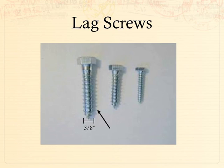The head of a three-eighths inch lag screw is actually nine-sixteenths inches. So when you go to get a socket for driving these into the wood or material, you have to get the appropriate size socket. You could try to use a crescent wrench, but it doesn't work very well because you can't apply the force downward toward the shaft like you would with a socket driver — you have to have that driving, pushing force.